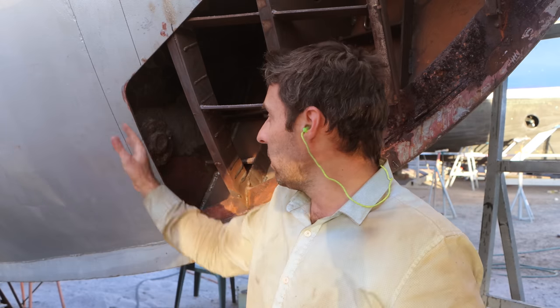Now some people would say you can weld a plate over top of the corrosion. Absolutely don't do that. It's a terrible idea. The reason being is because if you get rust between those plates, you haven't stopped the rust, you haven't stopped the problem in the back plate in the first place, and you're just pretty much hiding it, and it will fail on you.